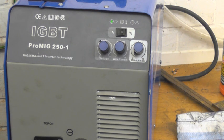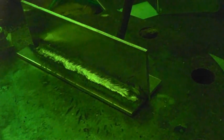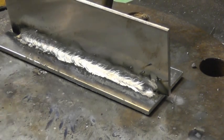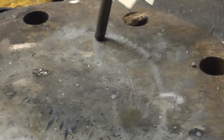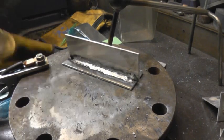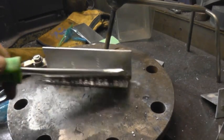These are the power settings for the 3mm aluminium, still running on the 30 amp supply. That's a decent weld — you can tell by how it's welding, it's getting a decent hold. It's penetrated right through as well. That's as-welded without being cleaned up, and the anti-spatter spray certainly made a big difference. You can see it's penetrating all the way through. All it takes is a rub with the wire brush — that's quite a respectable weld, certainly ten times quicker than TIG welding.